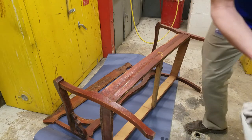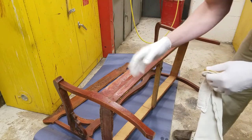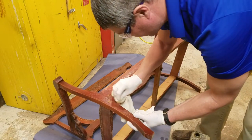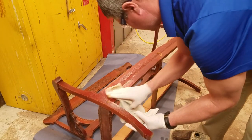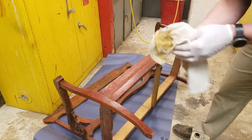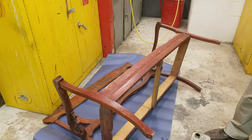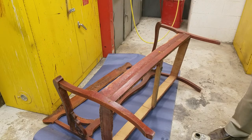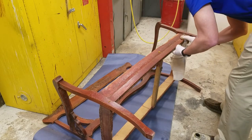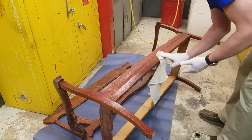If it starts to gum up or fill up the rag, you're going to have a hard time pulling it off, so make sure you have a metal scraper. This hasn't sat long enough to completely pull the finish off — it still needs to sit a little bit longer. The product says two minutes but it never really works for the entire thing in two minutes. As you can see though, it's pulling all that finish off — it's just shellac-based. Paint thinner on shellac won't have the same effect. There's actually just a very thin layer of finish on this piece.